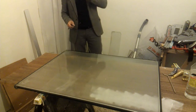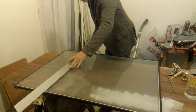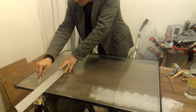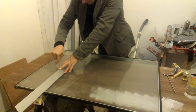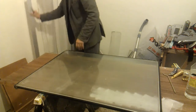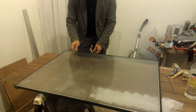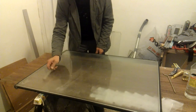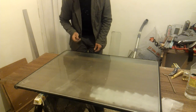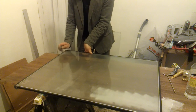Where is my straight line? Here it is. Not too much tension, not too little tension. You have to take a piece of old glass and do some exercise before doing that — unless you work in a glass shop, then you know exactly how it operates. And tapping, tapping, tapping, tapping, tapping. But this time you will see I will not apply almost any force and it will go — and it's done.